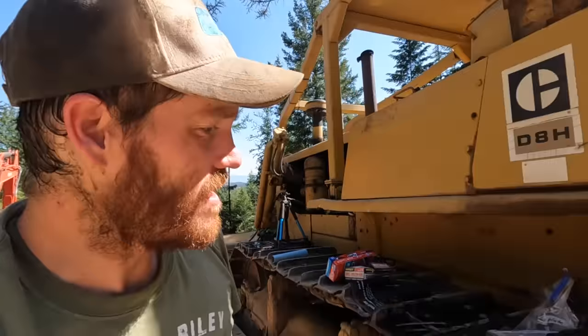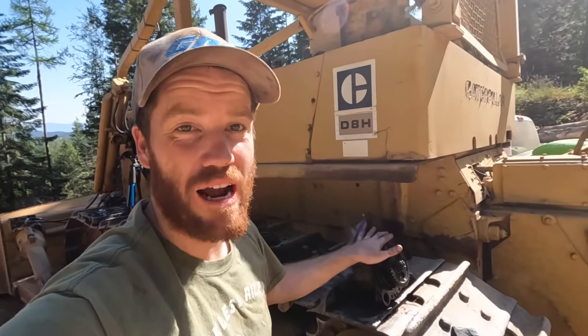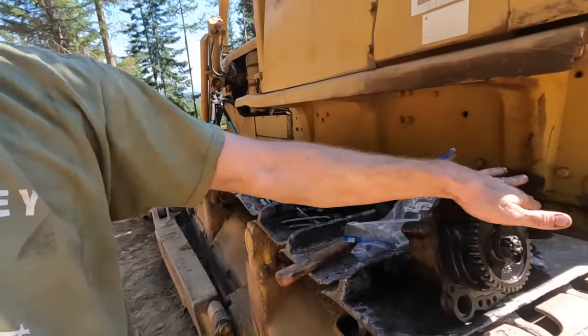It's been a long day and I haven't been filming very well, so let me show you what I've gotten done. This is the scavenge pump — this is what pumps the oil out of the torque converter housing back to the transmission. I tore it apart but it looks okay, spins nice and freely, I don't think that's the problem. Which pretty much just leaves the torque converter itself, so I'm going to have to pull it out. It weighs 850 pounds and I'm not looking forward to this, but it's got to get done.